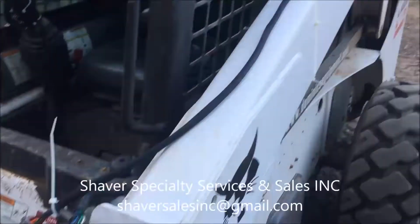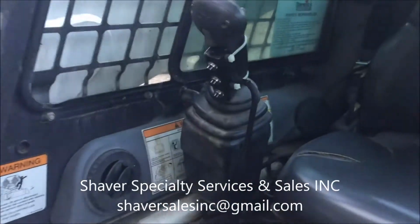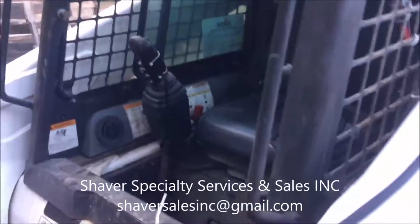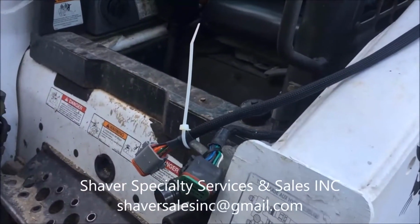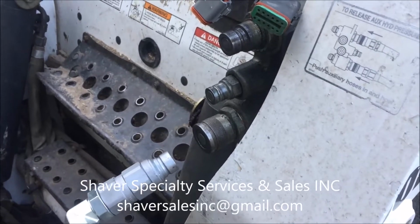Alright, I pretty much did a quick and dirty wiring harness install. I did get the new buttons put on the inside. Got the little green light up there for the cigarette plug lighter, so we're good there. Always important to check before install to make sure you do have an actively working 12-volt power supply in the cab.